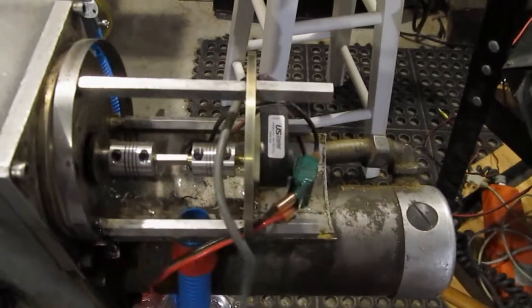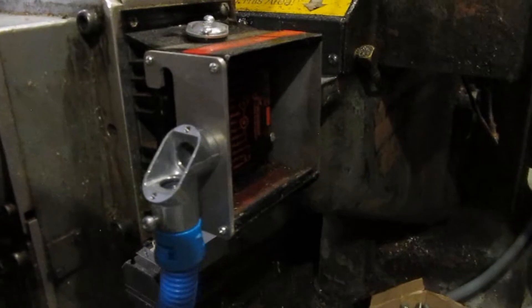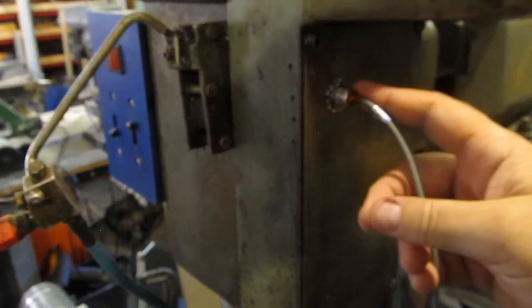As you can see, I've still got all my cables — I've got to thread all of them down and in there. They come around over here to the Gecko drive, which is located up inside of here. I've got to get that wired up, and once that's wired up it'll be good to go. This mill has never had limit stops before, so I'm putting in some hall effect sensors.